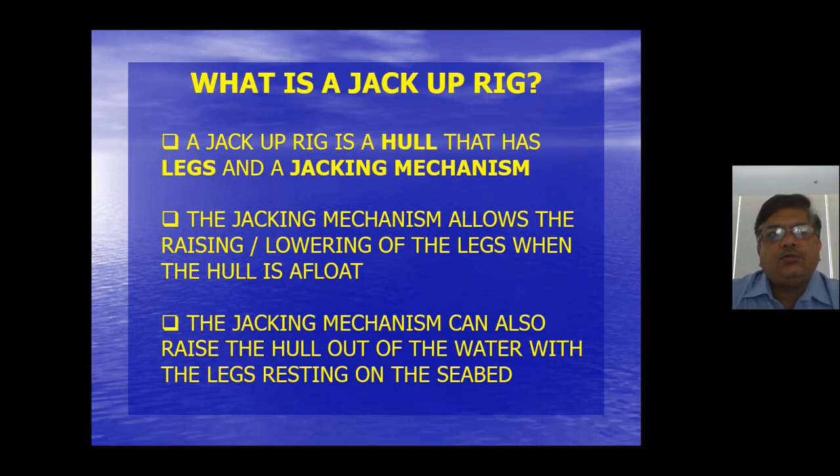For example, if you want to install offshore wind turbines or do blade repair work, these things can be done when the rig is stable in one place. The legs go down to the bottom of the ocean and touch the seabed, then the entire hull — main deck, engines, everything — is jacked up out of the water and suspended above the waterline.